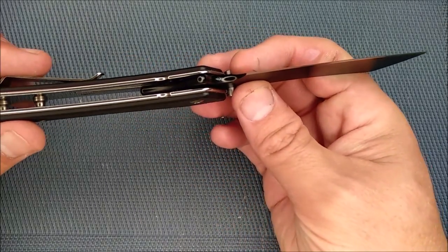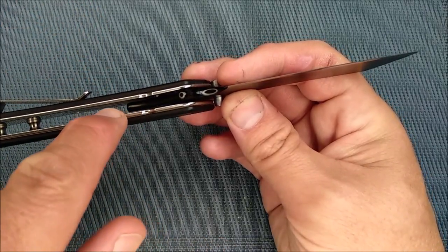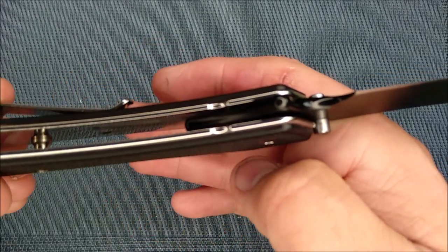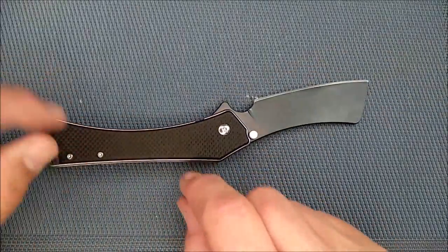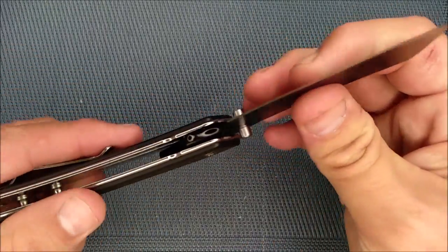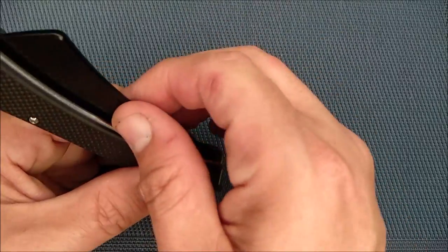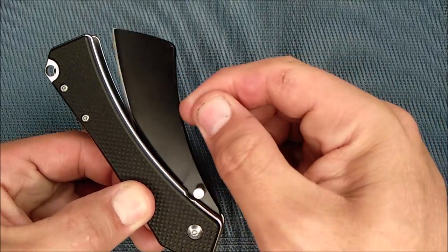On this knife, you can sort of see it on that inner side right here. If you can see that little bit of a line right there on the liner — you can just barely see it. When I turn it like this, depending on how the light goes, you can see there's something going on inside the liner on that side. There is a bit of a spring arm there with a detent ball putting pressure onto a little hole on the blade, and that's what keeps the blade in place. That's the detent ball clicking in place. They've got the same thing using the same detent ball for when you close it.